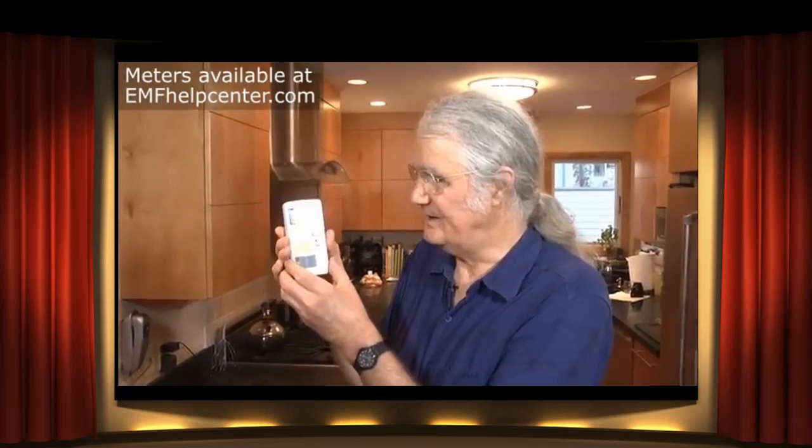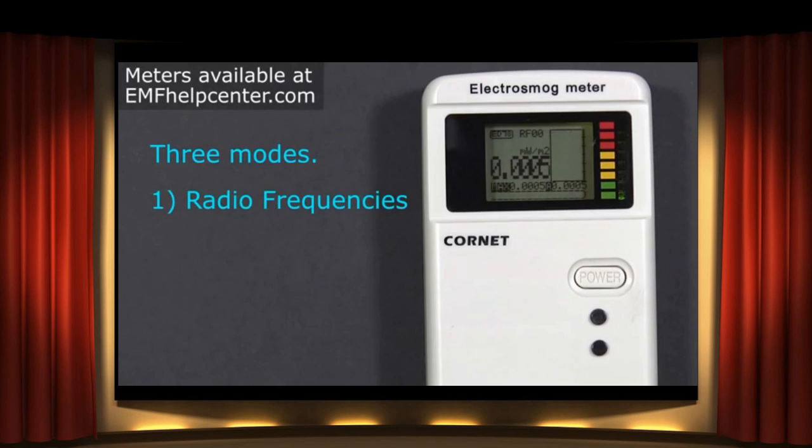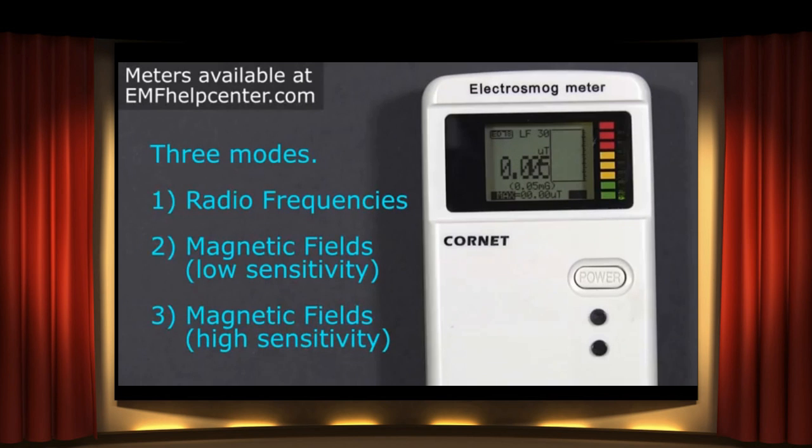So on the Cornett ED78S Electrosmog meter, the way you operate it is you press the power button, that turns it on, and the first type of EMF that it starts to read by default is radio frequencies. If you want to read magnetic fields, you press the top black button, and then it will start to read magnetic fields at one setting. And if you press it a second time, then it's a more refined setting. So you can toggle through these 3 types of EMFs by pressing this top button.